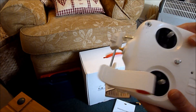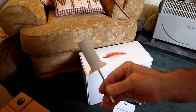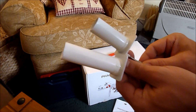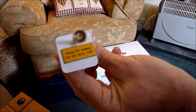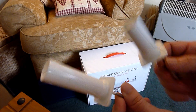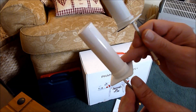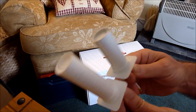The addition of my aerials — originally I was using 9dB on the 5.8GHz and that got me out 2 miles distant, but I've since replaced that with the larger Horizon 5.8GHz — left hand circular polarised, I believe this is 12dB as opposed to the 9dB of the original. Very, very good antennas, can't praise them highly enough. Will runs off his feet producing antennas, so don't expect an instant reply — he does his best but he's often very busy, and he certainly provides outstanding service.